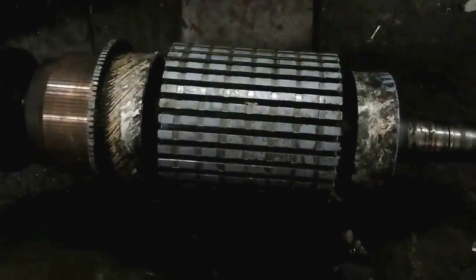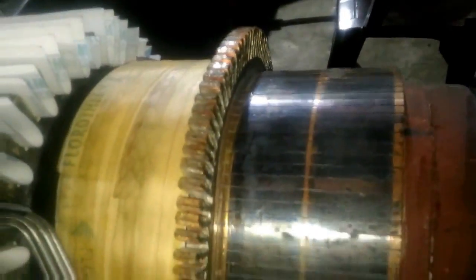From this point on we have to see the coil preparation. The slots are all cleaned up — you can see the slots are very clean. The commutator segments are cleaned up and have been tested; all segments passed through testing. One of the sample coils is already placed in position. It's a pitch of 1 to 10, and the armature is ready for winding.